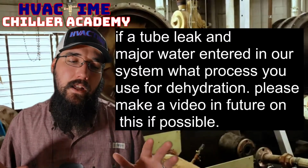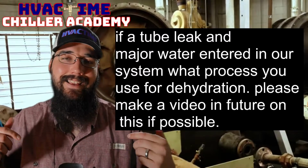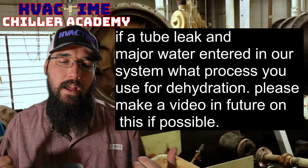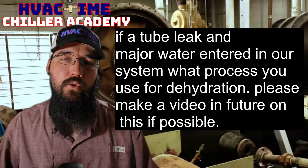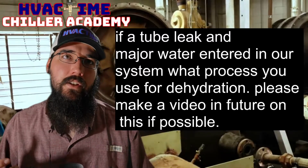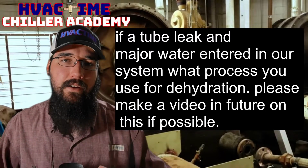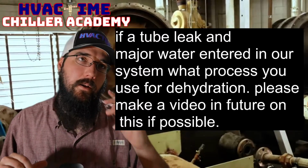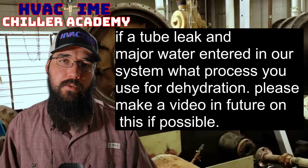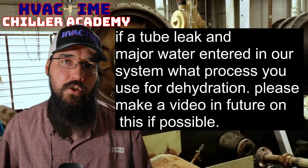Now, let's say you caught it relatively quickly and you've got water in your heat exchanger. Things haven't been in there for very long, let's say hours to days at most, and you responded quickly. Well, there is still some risk, but there's a chance that there's not extreme corrosion yet. So you're going to have to retube either way. You're going to have to at minimum retube because you've got to do that to fix the leak. If you had a leak bad enough to cause that, I don't recommend just plugging the tubes.